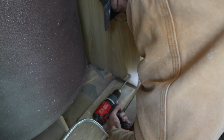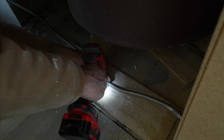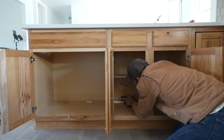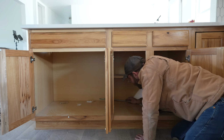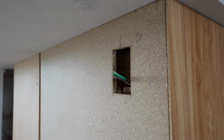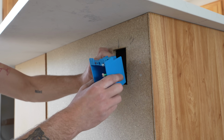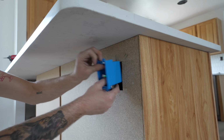I believe this is a 5/8 inch spade bit that I'm using to drill through the cabinet walls. That way the conduit and wire can feed into that box. And I did make sure to anchor this down. And I'll be picking up some specialty conduit clamps for inside of the cabinet. You can see those on the screen now, and I'll make sure and leave links down below to all the tools, materials, and supplies for this project in the description. I won't be wiring this outlet until our final step after our paneling is on, so let's keep moving.